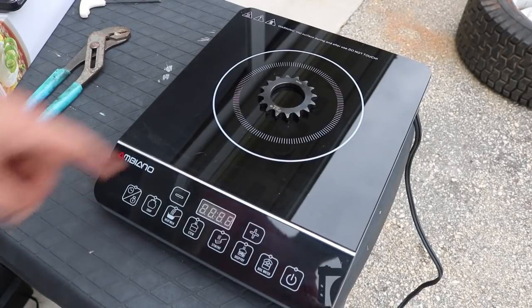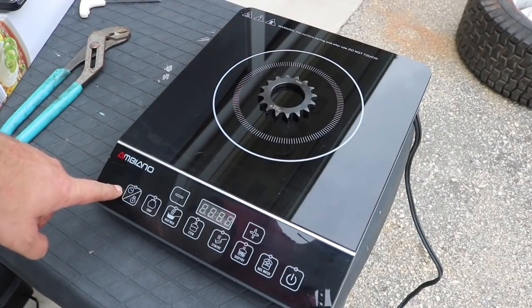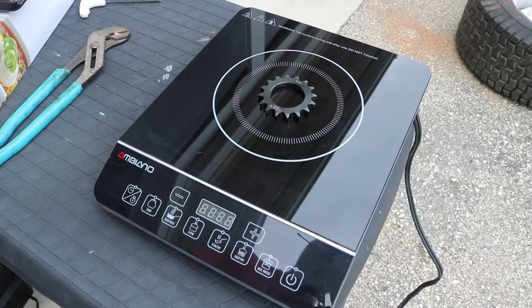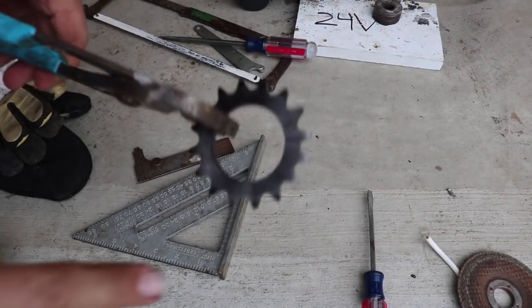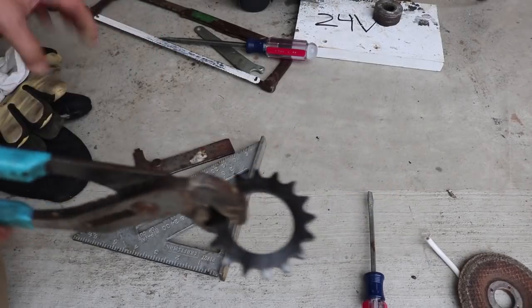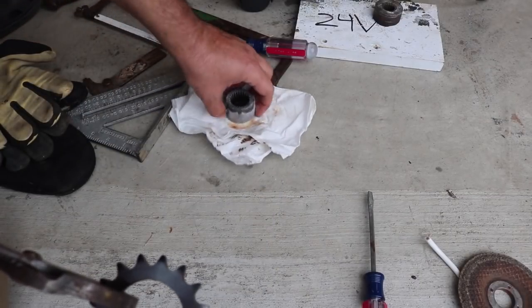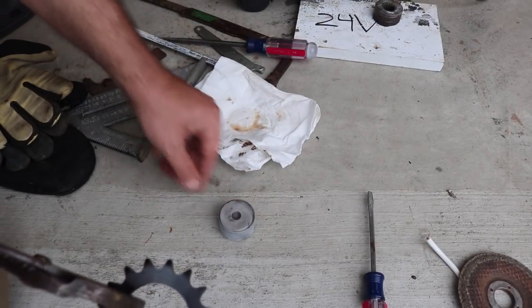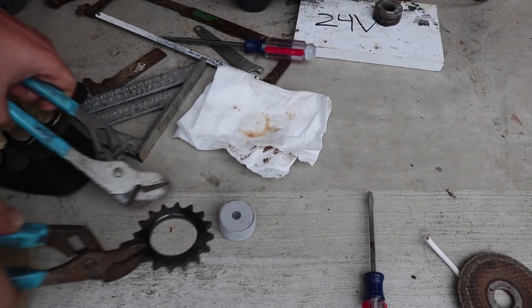Next I did a little experiment. I was hoping to use an induction hot plate to heat the sprocket directly, but it has a feature preventing use with anything smaller than a frying pan. I tried putting a frying pan on there to transfer heat, but that didn't work either. I gave up on it and just put the sprocket in my regular oven. The sprocket came out hot and the hub came out of the freezer cold and frosty, and I was hoping to get these parts to press together because of the thermal expansion difference. Here goes nothing.